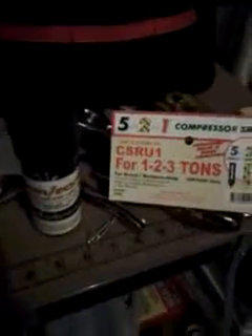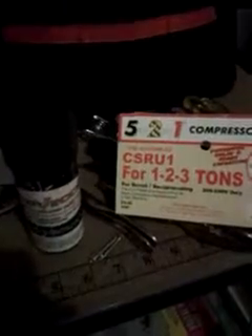Hi, I'm just doing a follow-up video for my other video, where I discuss the different types of start kits available for your air conditioning condenser system. This is one type, which is a PTC-based relay — a relay that works off temperature. It's all in one unit and it's two-wire, so it only takes two wires to connect it.